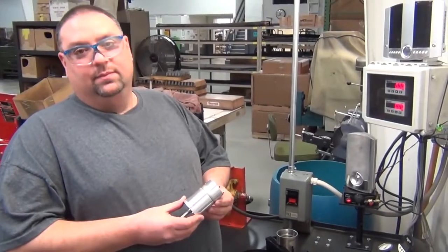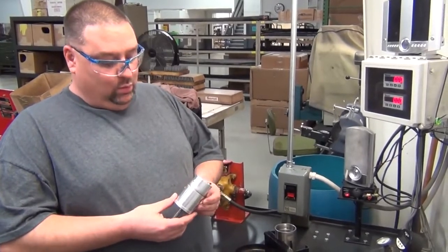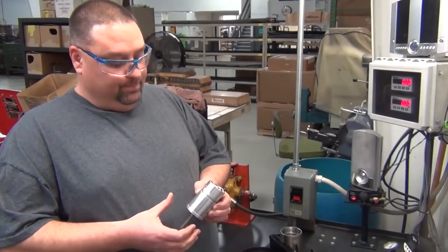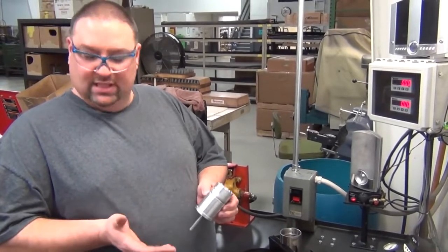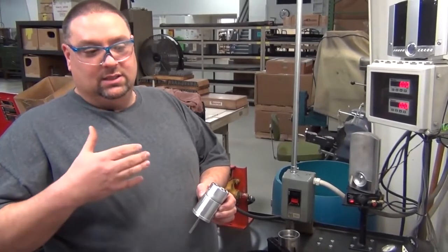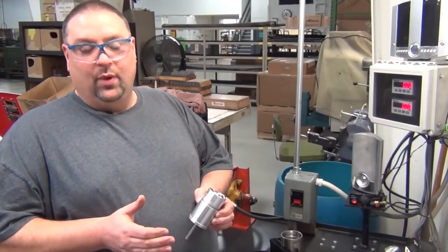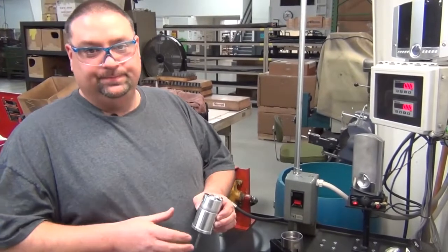And after checking the slip here with our unit, we will go ahead and take it apart to check for any visual damage to the motor. With the test that we've done, we determined the slip is good. It was reading 0.2 on the slip. The range of the slip is 0 up to 0.5. Anything after 0.5, there'd be too much oil passing underneath the gear.